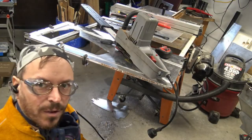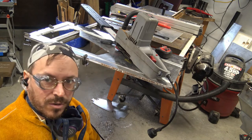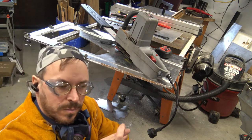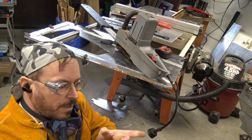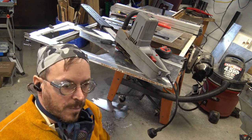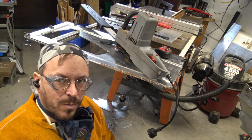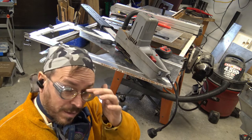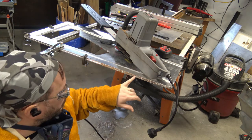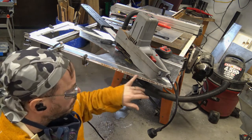One big thing I found when I was doing the aluminum welding, the first time I welded in that initial video: one, my shade was too dark. I couldn't see what I was doing, so that was a big thing, of course. I couldn't see the puddle. You need to be able to see the puddle being formed when you're melting the two base metals. The other thing I found was that I didn't have my gas set quite right. Once I got that, this isn't buffered, but this is how that looked.